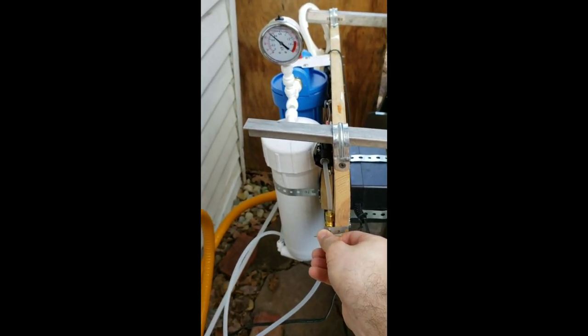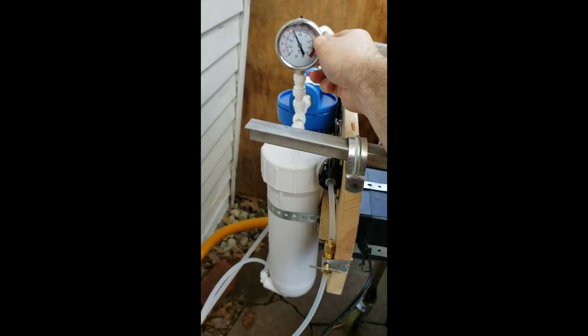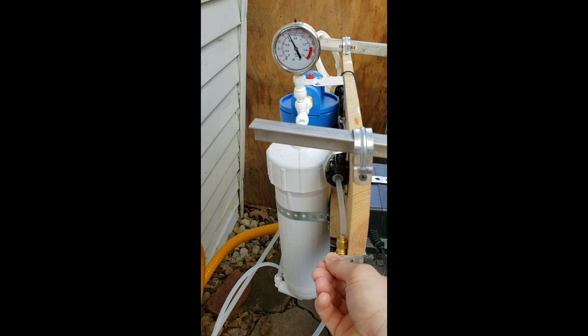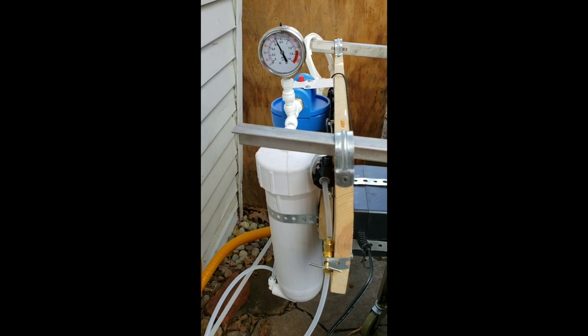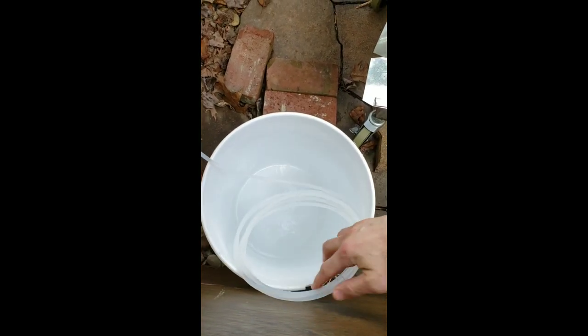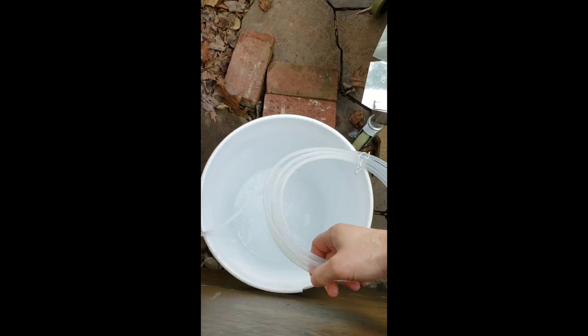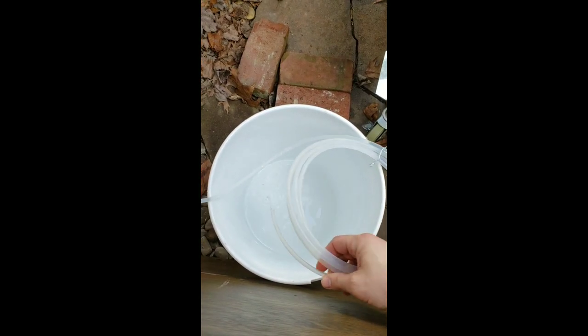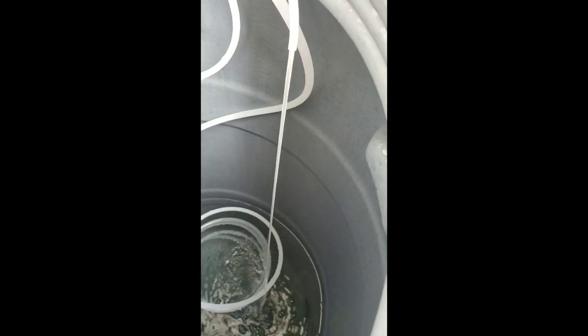About a quarter turn from fully seated. You can see that the pressure of the system is going up — we're running right around 100 PSI now, and that'll typically stay around 100 to 105 PSI. Down here we've got permeate — pure water — starting to be pushed out of the sap. That flow rate should be about the same as the concentrate flow rate. You can see our concentrate still coming out a little bit higher, so we may want to tighten down that valve a little bit more to get those flows a bit more balanced.